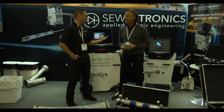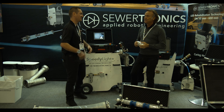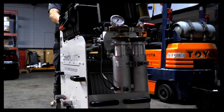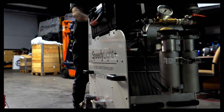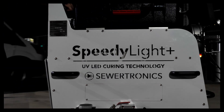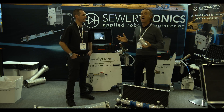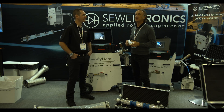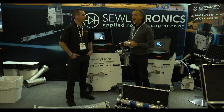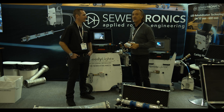We have behind us the Speedy Light Plus. We like to call it a game changer because that's what it is. It's a game-changing technology that will allow you to cure lateral pipes, indoor pipes, as well as mainline pipes ranging from 2 inches up to 24 inches. We cure using light and special UV resins, which allows you to go faster on curing times and be safer on the job site — no problems with ambient curing epoxies. One single machine covers 2 inches all the way up to 24 inches.